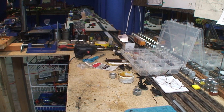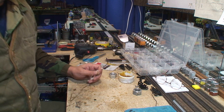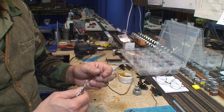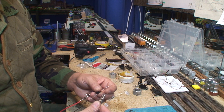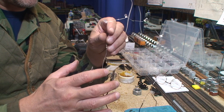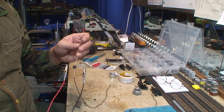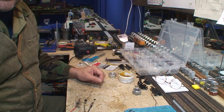It is an extremely handy little tool to have. Using the bridge rectifier right here means that when I hook up my alligator clips, it can be AC or DC, and it doesn't matter which side goes where. The rectifier fixes everything, gets all the electricity going in the right direction, and we don't have to worry about whether we hooked it up wrong. If you've got the rectifier in there right, you're good whether you connect it to AC or DC. I'm probably going to use AC power — my hot leads will be AC instead of DC.